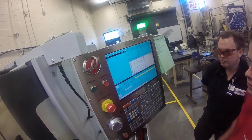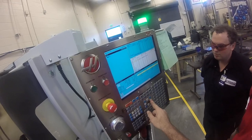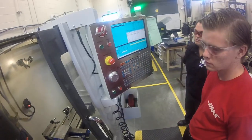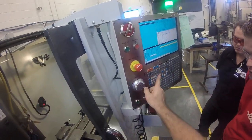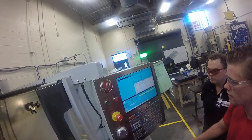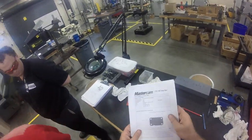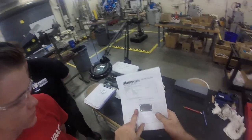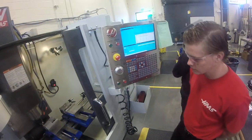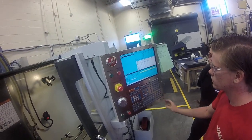Let's use part zero set — that actually just takes this number and puts it up here. It jumps over, so you need to do some more coordinate shifting. That is one hundred thousandths — and which way are you going to shift it? Positive. So let's do an addition there. Now looking at my setup sheet, it says right here: shift the X plus fifty thousandths. So we're going to do another additional shift.